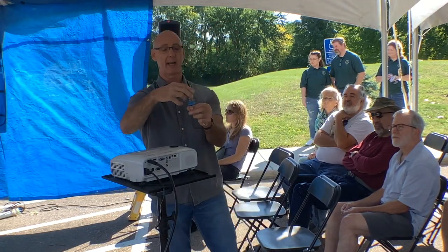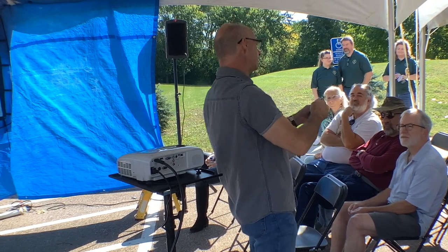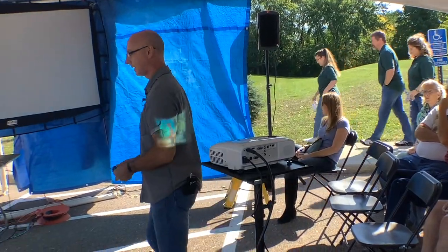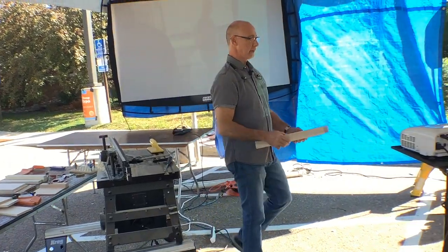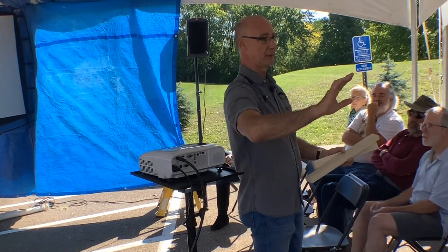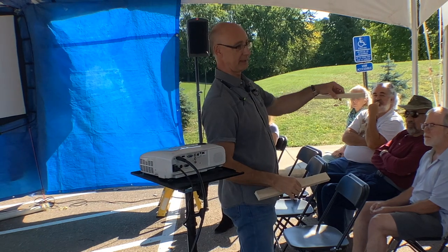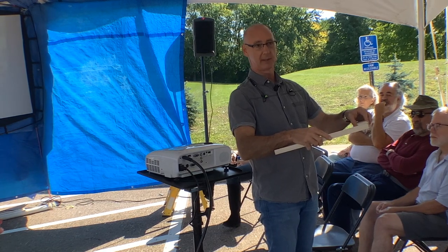So I did that in my cabinet making classes for a really long time. And when we put the doors together in the end, six or eight people in a class, four doors would be great, four not so much, six doors would be great, two not so much. A thing I harp about a lot is when you choose a reference edge, reference face, reference surface, use that as repeatedly as possible. What was happening with those doors was one of those cuts gets fed good face down on the router table, the other gets fed good face up. That's what was messing us up when we brought those parts together at the end.